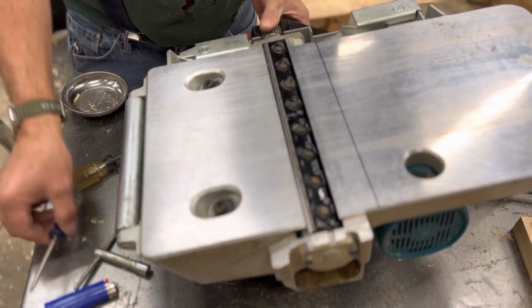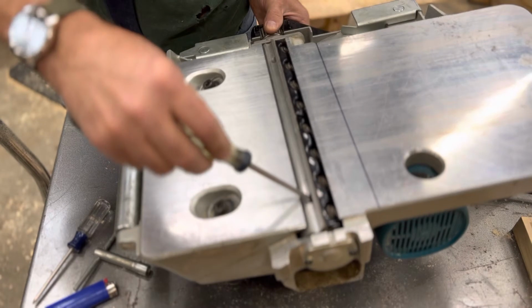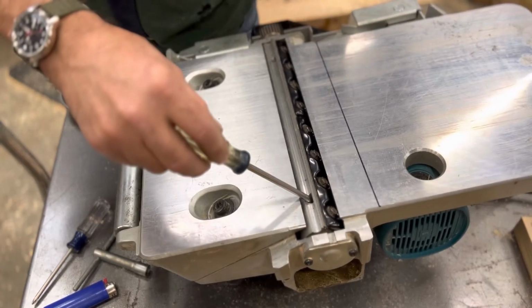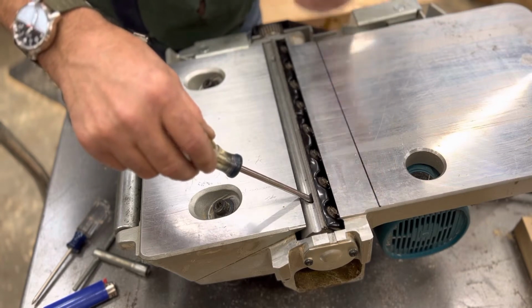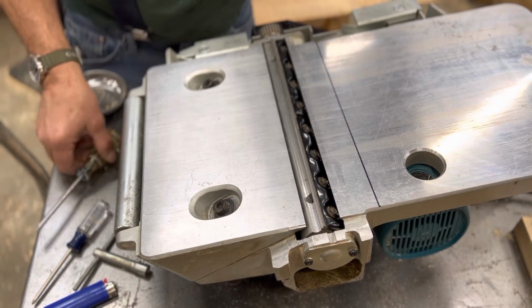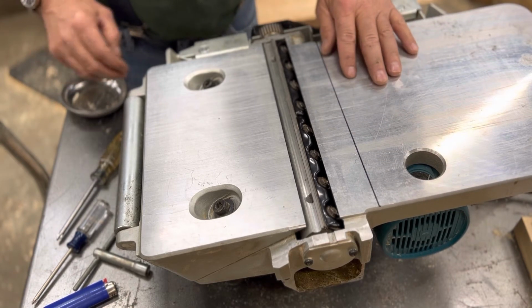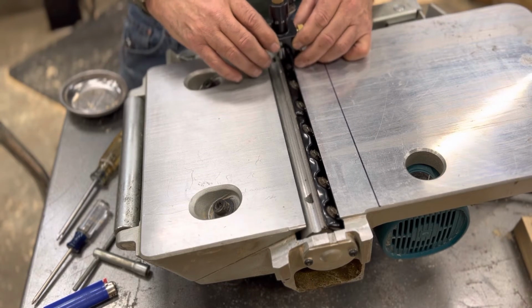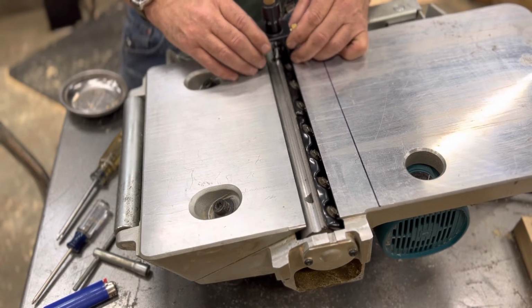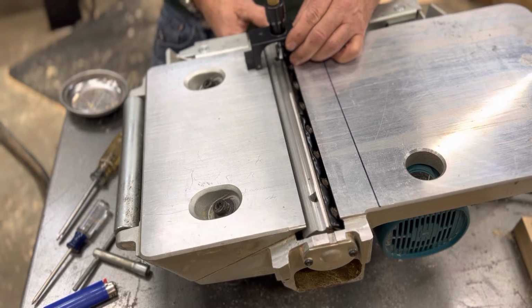And then you're going to set your adjustment with a screwdriver here. This is going to raise or lower your blade height to where you want to get to. I was initially using a dial indicator to set these up, but because this is magnesium, the dial indicator mag base doesn't fit. So I've got one of these rigs here, and this is what I use to set the blades up with. You can put it on edge like this, bring this to the top dead center point.